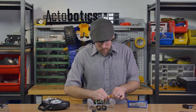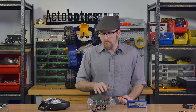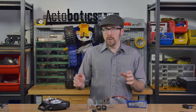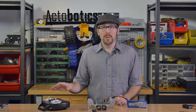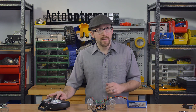It's worth noting that you can turn on the board before or after you power on the transmitter, receiver, or Arduino — wherever that signal is coming from — because it is not doing any sort of on-boot calibration like some other motor controllers do. Motor controllers like the Roboclaw really want you to turn on the transmitter first, but in this case it doesn't matter.